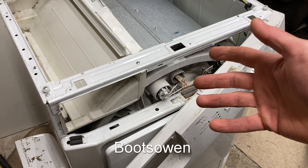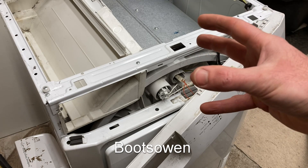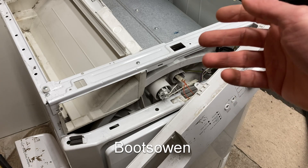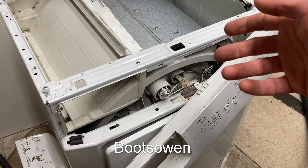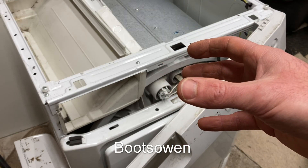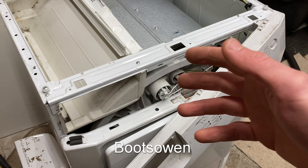Welcome back to part three of this series. I plugged it in just before part two and it immediately blew the fuse — the residual current device in the house — which suggests earth leakage, but could be positive, live, or neutral leakage. The lights went out and it was night time, so I had a look but couldn't see anything obvious.